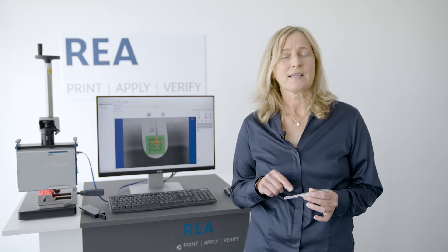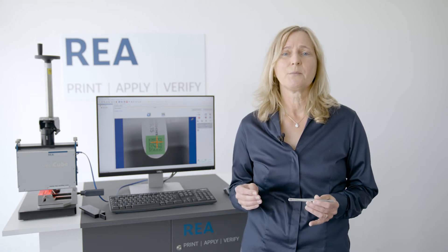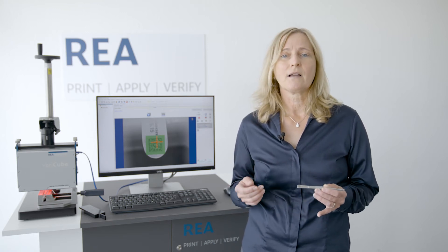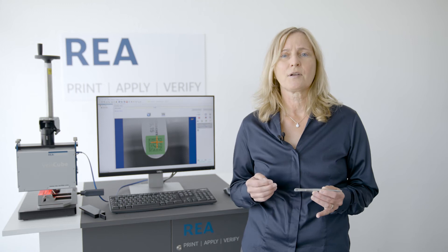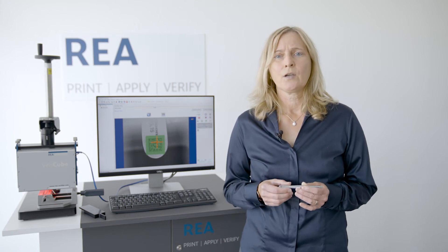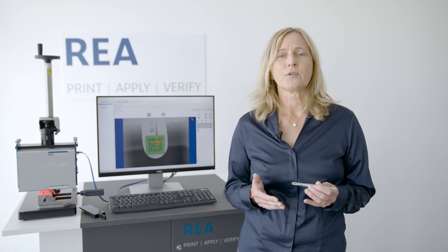In this case the code lies recessed, so we have to use a camera module that is focused 15 mm above the glass pane. During the measurement the code must lie in that focused level with a tolerance of about plus or minus 2 mm. We recommend using our VeriCube stand, small Ys, and our focal distance tool.